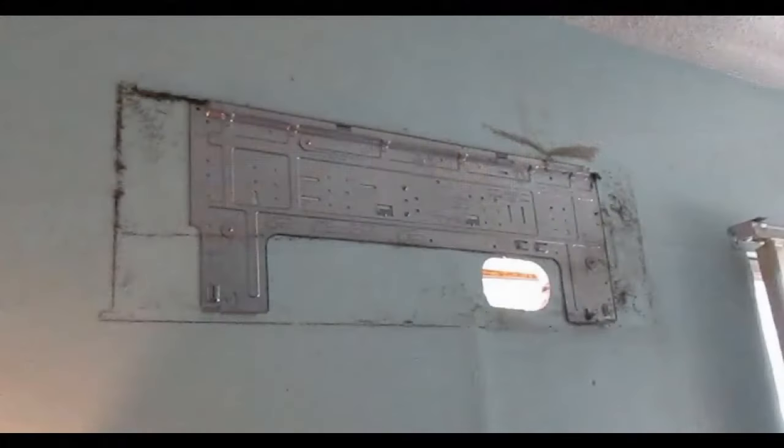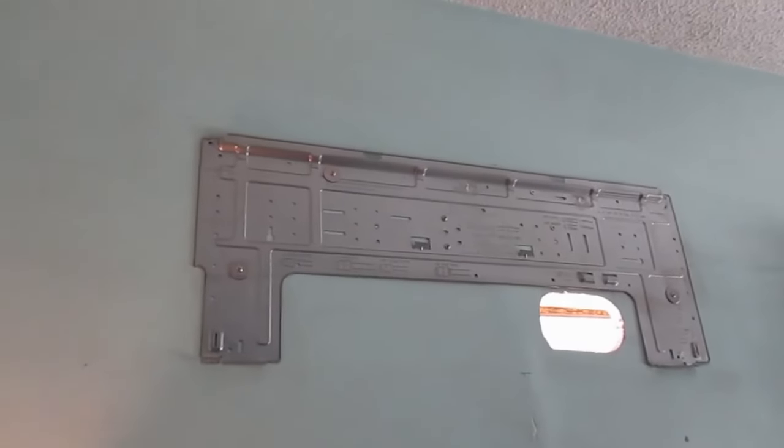And now we're looking at the screws that hold the whole unit in place on the lower part. You can see it's covered with dirt and webs, but I just wanted to give you a shot of those screws. Remove those screws and you can take the whole unit off. Now the upper part sits on kind of a lip on this metal bracket, and you can see the metal bracket there is just caked with dirt around it. Here's another shot where we cleaned up around the metal bracket, and there's the lip I was talking about. That's where the unit sits. Basically sits in that lip, and that holds the weight of the entire indoor unit.